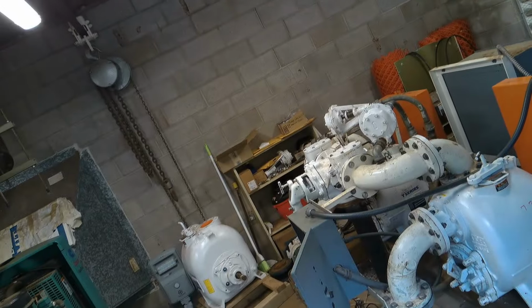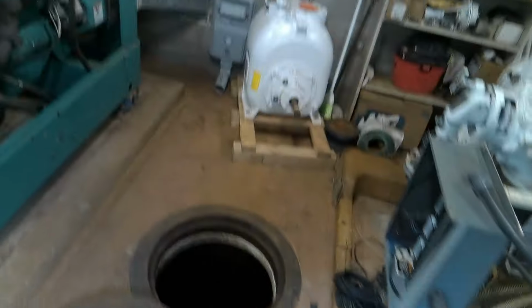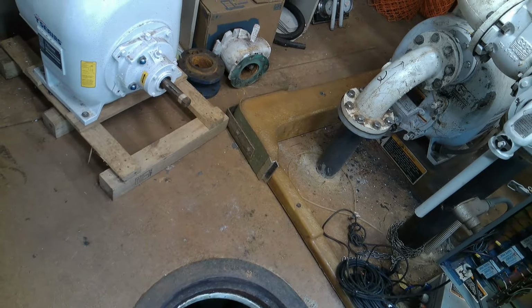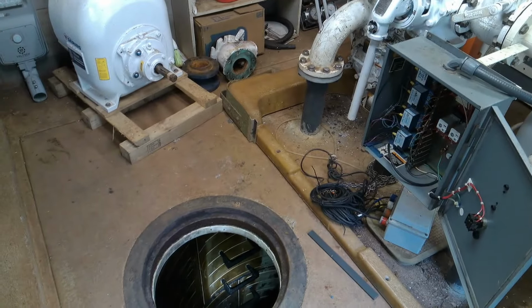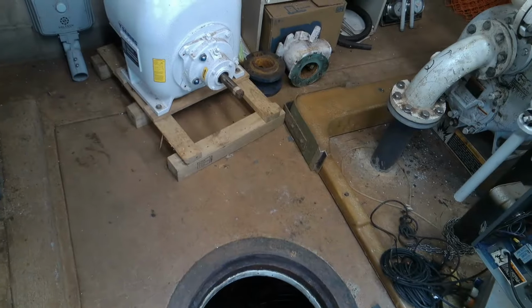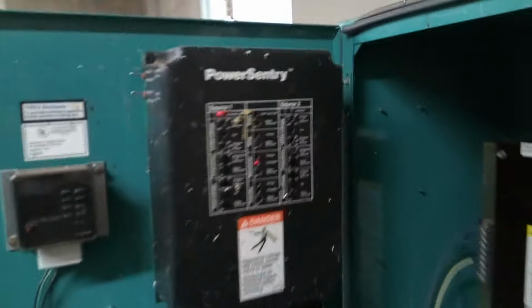When I got there, I opened the wet well and the grease line was all the way up. Randy said that when he got there earlier this morning, the red light was on, but he didn't open the valve. He said the pump was running and it was normal, so he just silenced the alarm and left. When I got there, the pump was running, the only one that I could hear, and when I opened the wet well, I noticed there was a line on the top of the backwater. It was all dirty, so I knew something was up. But I didn't get an alarm call.